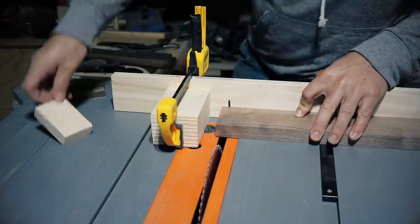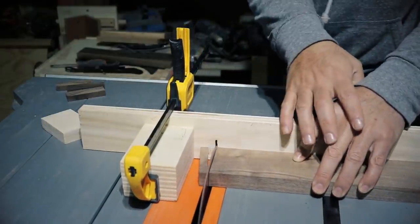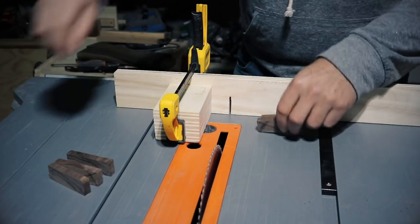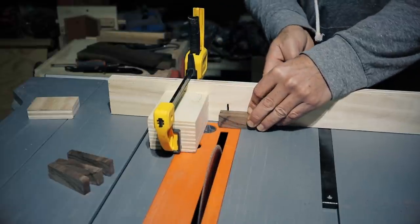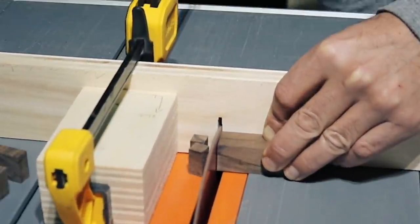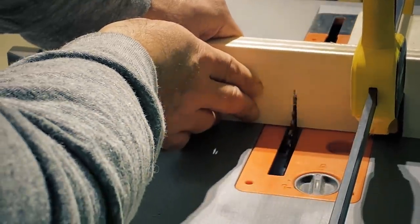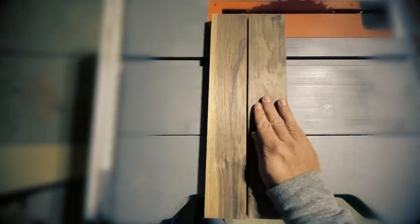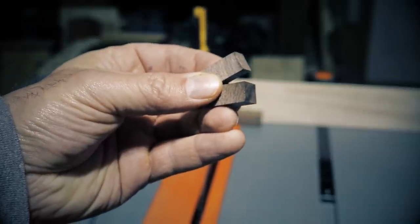So here's the first official pixel cuts. The larger stock gets cut down into several strips. Then you take a couple of those strips, put them up against the spacer, hold them tightly against the fence, and run them through to get your pixels. From the back, the motion looks like this — it's my right hand that supports and pushes the fence. I also ripped my stock in half, which helps minimize the impact of any unsquare angles. Well, I got two done. Let's do the other 150.